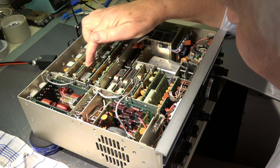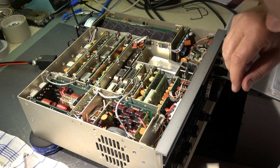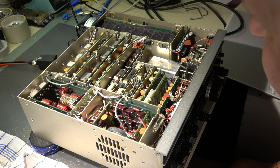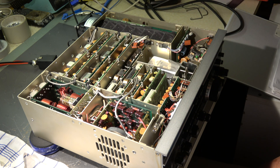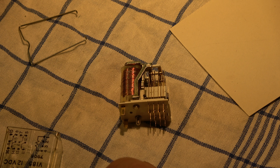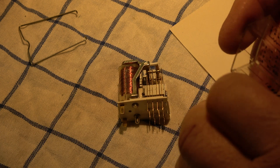I set the filter board back in, also the noise blanker and the mixer board. I removed the shield and now have access to the other boards. I will take them out for optical checks, clean the contacts, and reinsert them. After cleaning all the contacts of the plugged PCB boards, the contacts were all clean and shiny with no signs of corrosion. The solder connections on the plugs were also okay, so I don't think there is a problem there.